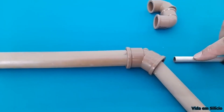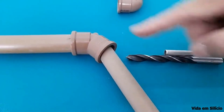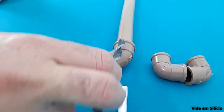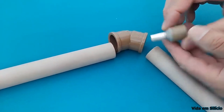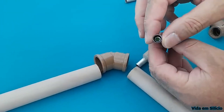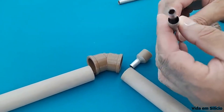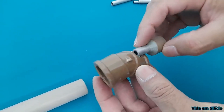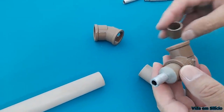So I am going to attach a small piece of this pipe here to this connection. We are going to use a drill with a very similar diameter, and this hole has to be aligned with the center of this tube here, so I have to make a hole in this direction. We cut the little tube here and made a change — this tube was the one I was originally going to use, but after doing a pressure test on the hose I saw that the jet wasn't very fast. So I cut a piece of this tube with a slightly smaller diameter and put it inside here, so we got a narrowing in the hole which will make the jet stronger. Now we are going to attach this tube here at the back. I have already put this piece of 20mm pipe here to make it easier to connect, and this other piece too, to connect the hose.